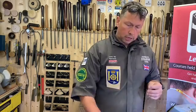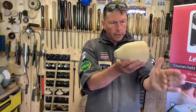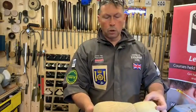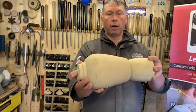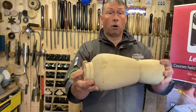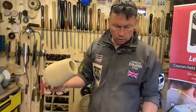So that's a friction chuck, jam chuck. That's to be used with putting a piece of fruit inside. That's an opposite version. Again, you could use that on a faceplate. You don't need to hold it in a chuck, so faceplate there. And that would be my way of reversing a hollow form pot or a bowl, something like that, so that the tailstock would push that onto the drive, and then you can turn the outside shape. This will still be on your faceplate, don't forget. Turn the outside shape, part off. So once parted off, that's your way of finishing the outside. So you've got all of these sorts of things to play with.